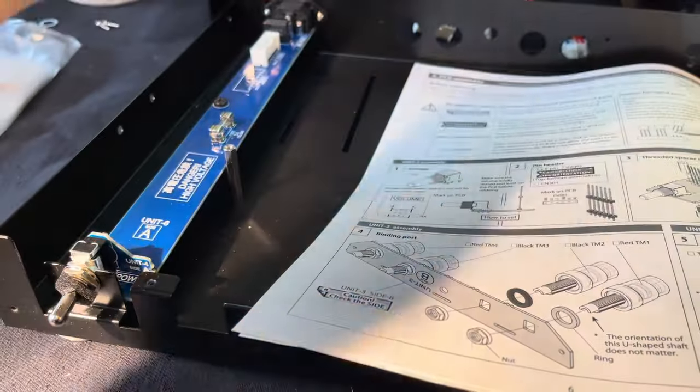To do that, you need to be pretty adept with the soldering iron. There can't be any solder connecting any of those joints together, and each one has to be sturdy — that's what's feeding your speakers. The booklet explains how to do each part. For example, it says resistors are not orientation specific, so it doesn't matter if you put one in backwards. A lot of components do matter, and if one component that does matter is put in backwards, the whole integrated amp won't work or might not work.